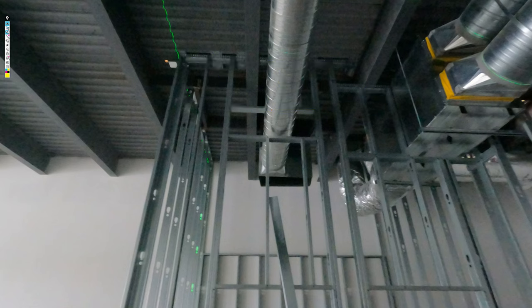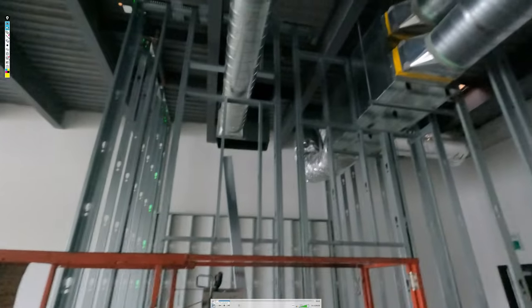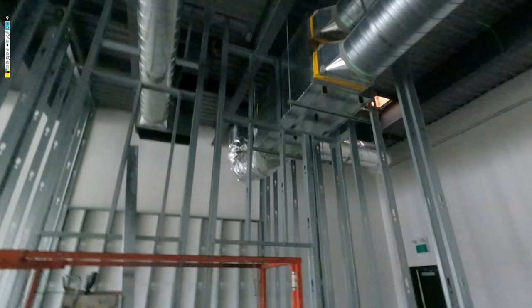And it's not that hard, guys. Just keep in mind, just use lasers and keep all your structure inside of where they're supposed to be, okay? You can see at the end here, okay, again, there's two studs, and then we have a clip in between to pick up this header, okay? And we have a stud going up, right? So we have steel around there.